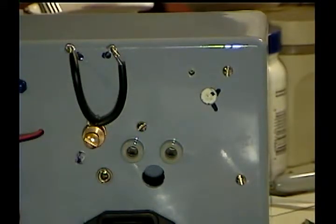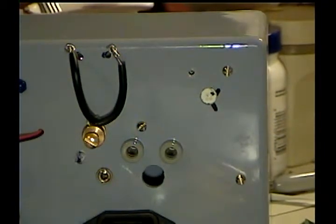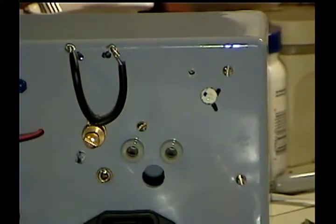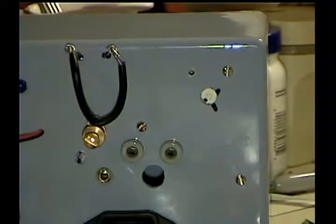The gain control is a fairly delicate printed-circuit-board-mounted potentiometer that needs to be approached with care. Even though the slots are crossed, they do not accept a Phillips screwdriver — you have to use a flat-blade screwdriver with an eighth-inch-wide tip. It's marked full clockwise right now. I'll turn it to about halfway so you can see the mark move. Wintertime operation uses about full open; summertime is probably about halfway — you'll have to test it yourself.